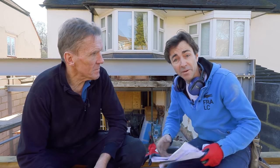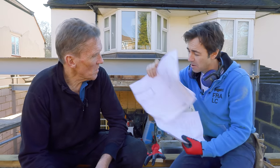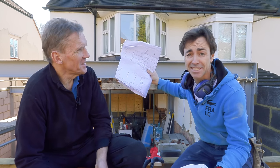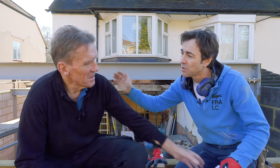Just a quick intro to this job. It's a typical domestic wraparound extension. We've got a flat area on top which is going to have a glass lantern, so we've got some flat roof joists to put in, and a series of rafters to go around. It's a little bit tricky in places. I've got a plan at 1:50, but when you actually get on site and see the walls and steelwork in, you've pretty much got to work with what's there.